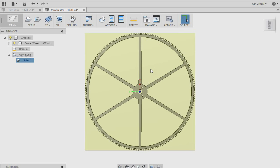and cut that piece out. The problem is that when you have a high-speed tool cutting through brass like this, when you get to that last point where you're freeing up the waste piece, the bit is going to grab into the piece and throw it. It can break the bit, or it can throw it back into the part and take a gouge out of it, or it can throw it right in your face, and that would be bad. So you can't do that unless this waste piece is held down in some way.